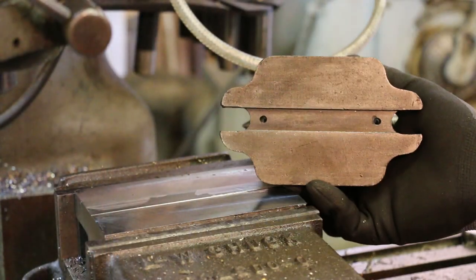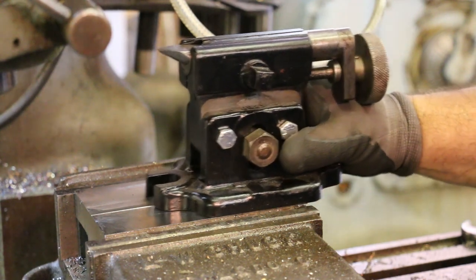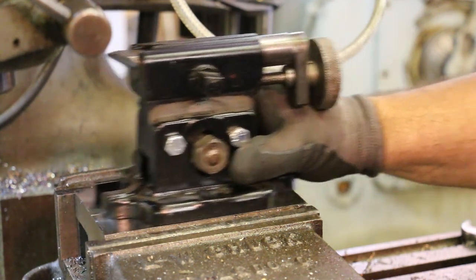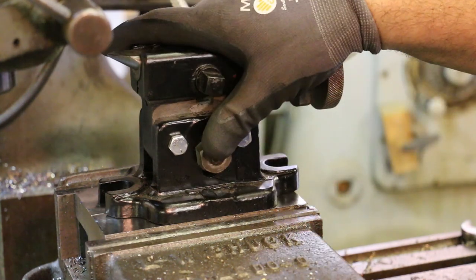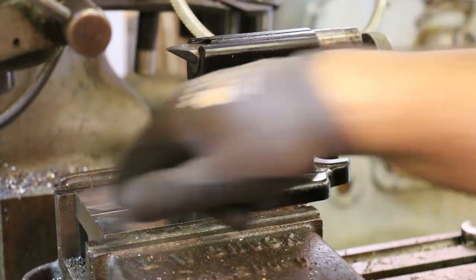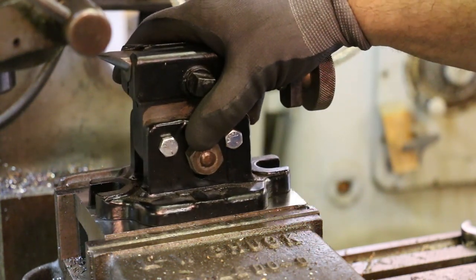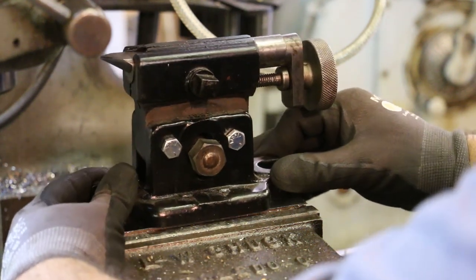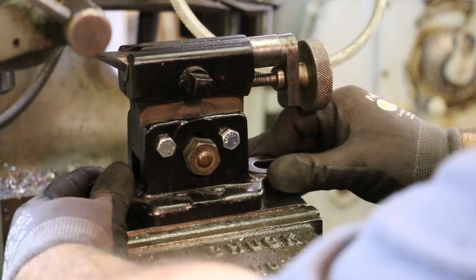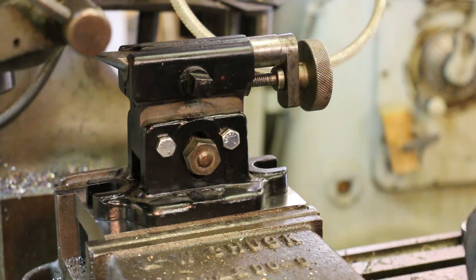So as you can see, we got a little T-slot in the bottom of this, and we've milled that little slot in there, and that is a nice fit. I mean, it's registering in there. It's not very high. I really wish that I had that full eighth inch in there, but it's enough to get it registered and on center, and it fits good and tight as far as side-by-side movement, so I'm happy with it. But it's not ideal, but again, we're gonna make do with it.